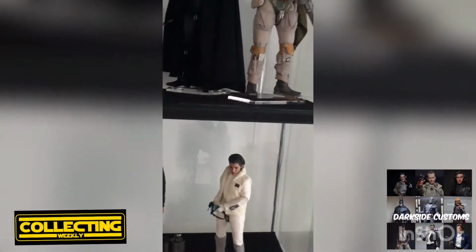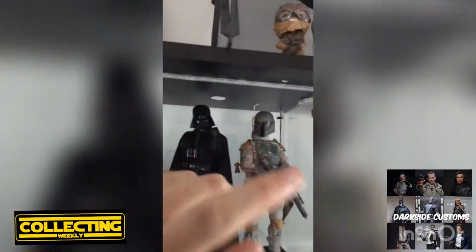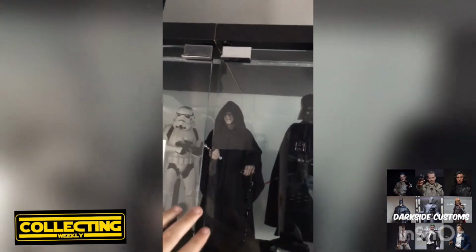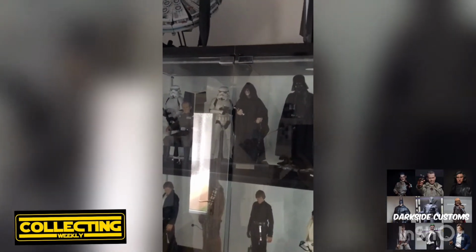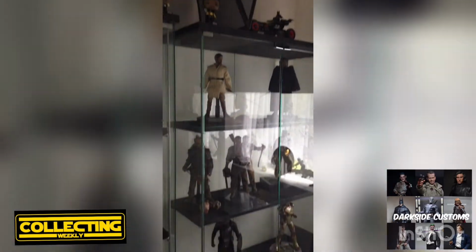You might get a bit of a gap. One little trick is if you get these little earth magnets, because sometimes these doors don't quite shut properly, the magnets are pretty crap, you can use them as packers. So if the glass is sitting out at different levels, when you shut the doors, you can pack the doors out. Because what I've done is actually removed the ones from the bottom. I'm not a fan of those. And that's it. That's how I did it.